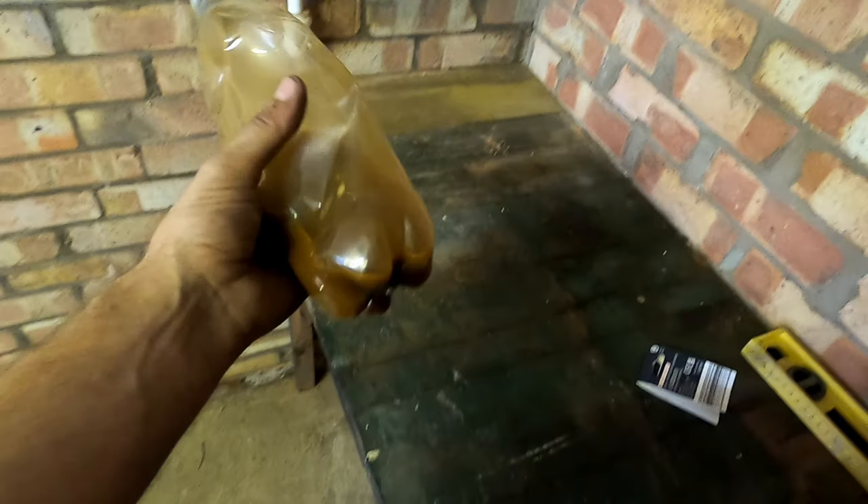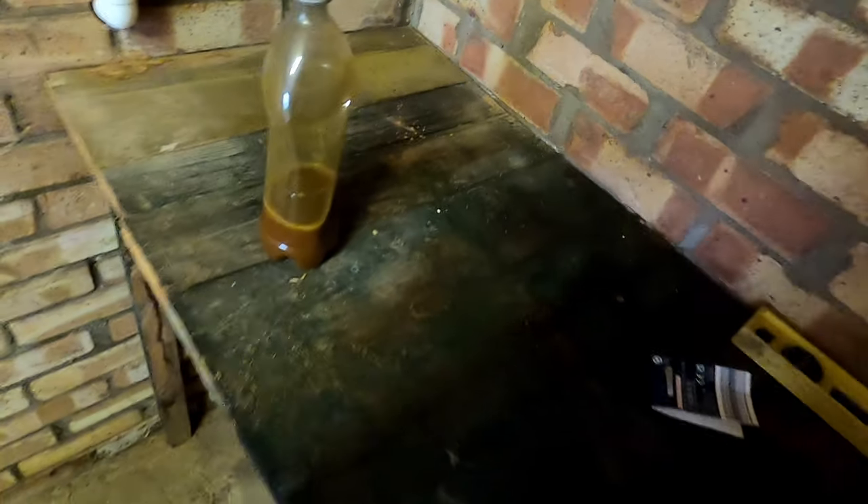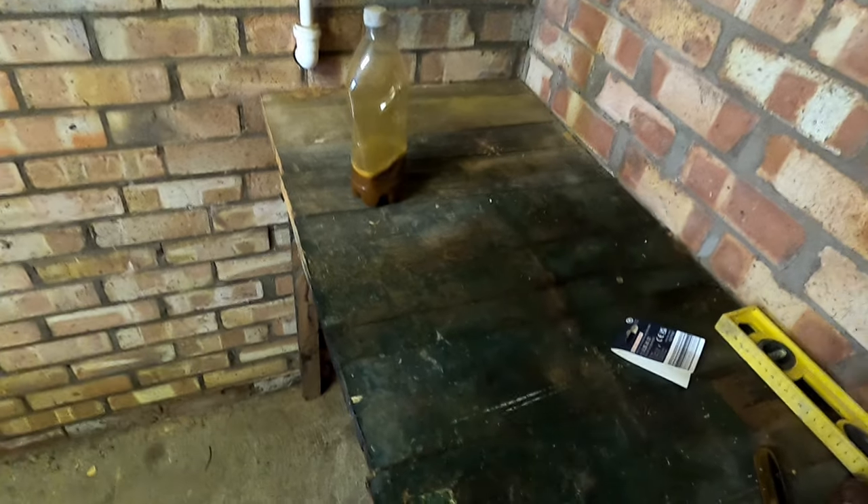Just before we get on, let's talk about water quality. I went to a job the other day to quote for a new boiler - she had some online quotes. I asked her what was wrong with the old boiler and obviously none of the radiators were working. I opened a drain-off tap and that is the color of the water - like cherry tomato soup. It was drawing in air, it was an open-vented system, all copper microbore, and I don't think any of the radiators were working properly. I've quoted to seal the system, do away with the little header tank in the roof, fully flush it, and see if we can rescue the system.